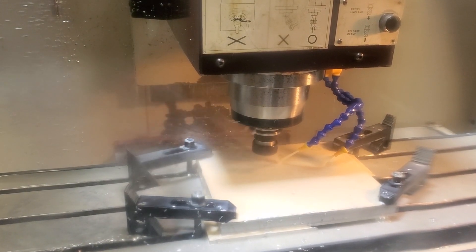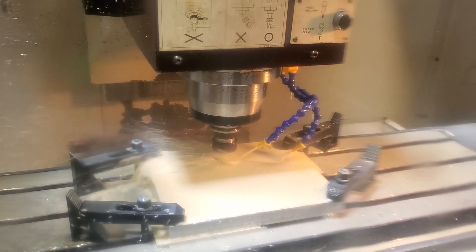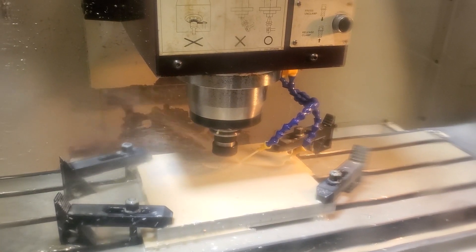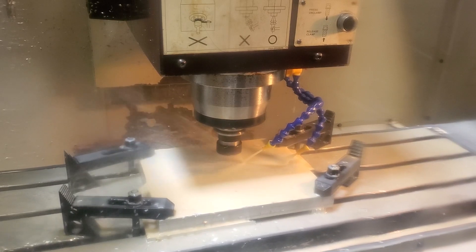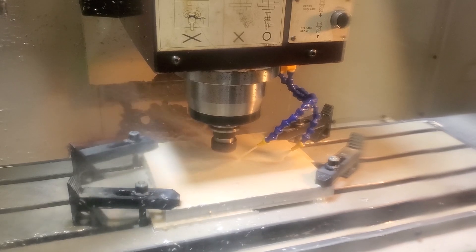This pulley is the first piece — really the very necessary piece — where we're connecting the generator and the turbine together. We do that with a toothed pulley to keep friction to a minimum and give us very good engagement between the two so there's no slipping.